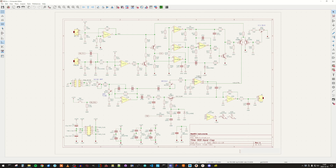I'm using an LM13700 here and I'm only using one of the devices in the IC, so the other one is unconnected and I'm not using the Darlington drivers either. I have added and modified the VCA trim pot a little bit. Since I have it on the front panel, I wanted it to be a little bit more usable, so I have adjusted the values a little bit.